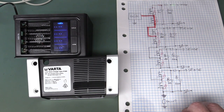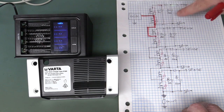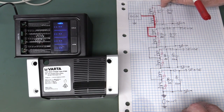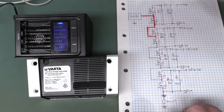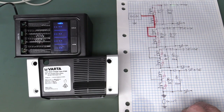Now if the lower MOSFET is turned on and you're bypassing a cell, what happens if you plug in a battery? Nothing — because the body diode inside will be reverse biased. The negative terminal of the battery is at the bottom, positive is up top, so the cathode of the body diode is positive with respect to the anode. The body diode is reverse biased, and since the gate voltage is zero on this N-channel MOSFET, no current flows out of the battery. All you've got is a sense line.